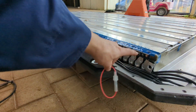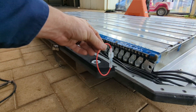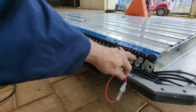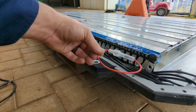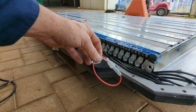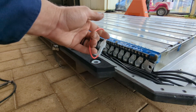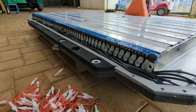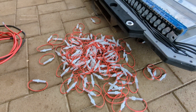I'm debating whether I should put a fuse to link a wire. These fuses aren't really rated to full pack voltage — they'll certainly break the three, six, or eight volts or whatever across here. But if this cell here shorts to this cell here and you've got 40-odd volts across it, this fuse will still blow but it's not what it's actually rated to do. I figured an underrated fuse is going to be better than no fuse at all if there is a short. Not that I'm expecting any shorts in this pack — and just as an idea of how many fuses I've got, quite a few to attach.